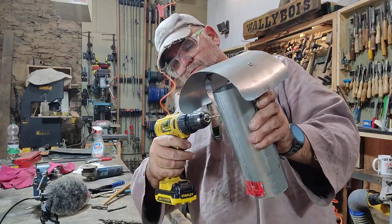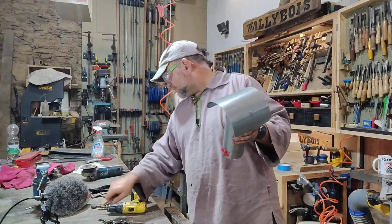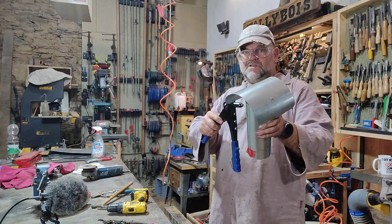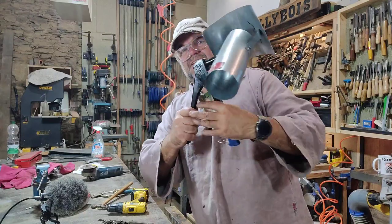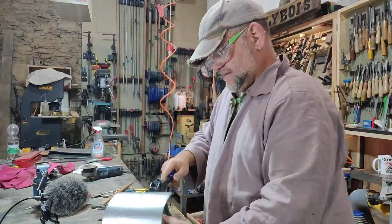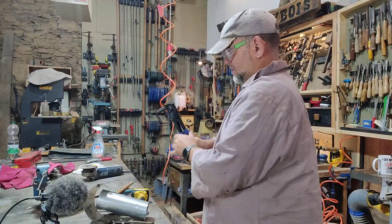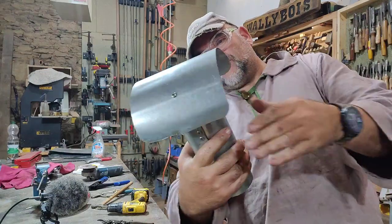There should be another rivet here somewhere — I did have enough rivets. I better just grab another rivet, probably dropped on the floor. That's a rivet. One more rivet. So now we've got one more hole to drill. Use the centre punch if you so wish — one tap should be enough. There it is, there's a little dent, so the drill's not going to slide about. Last rivet. Squeeze it up. There you go — so now it can't move. We've got a flue cap.